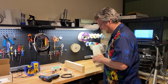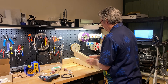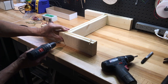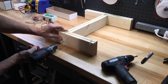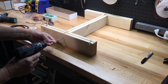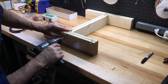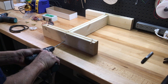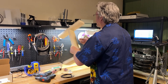This one is the one that swivels, so it can move a little bit to make the hive square. The other end then gets two screws — we'll pre-drill those as well. The four-inch screws are really long for this end, but rather than have two kinds of screws, we like the four-inch screw for the swivel end because it makes it really good and strong.